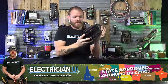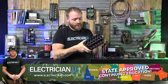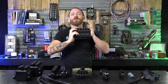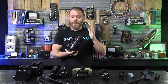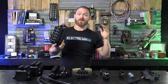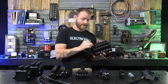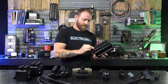This style is listed for conductors from 500 MCM to 4 AWG. Just because you're buying a 500 MCM tap doesn't mean every conductor has to be 500. Polaris taps are not as cheap as wire nuts — they're pretty costly — so make sure you get the right ones for the right size and right application, otherwise you'll be spending a lot of money unnecessarily.